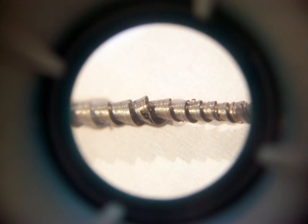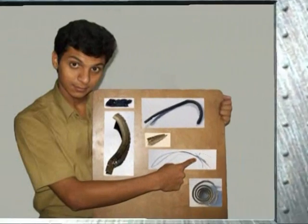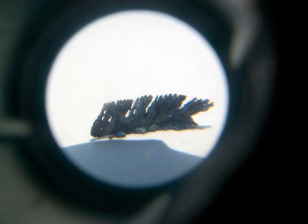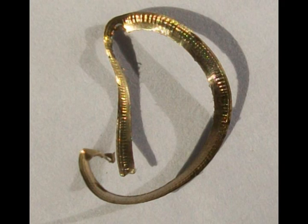This is obtained when the cutting speed is around 220 rpm and depth of cut 0.5 mm. Continuous serrated chips are obtained when a strain-hardened metal is machined at around 220 rpm and 0.25 mm depth of cut. These are the continuous serrated or non-homogeneous type of chip. The color changes are due to the high temperature attained during machining of mild steel.